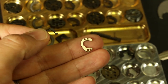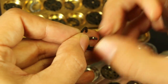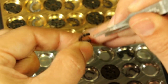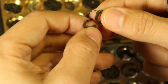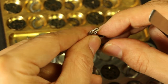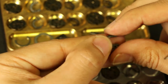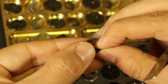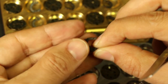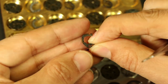So I'm wondering if these wafers have the same shape as the ones that have deeper false gates. The newer models have much deeper false gates — they look like a pinch right there. If you look from above, you can tell the difference because the true gate is open, whereas the false gate looks like it has a little piece of metal in the middle because of that little pinch. These smooth wafers don't have false gates of that nature. The older smooth ones also don't have the serrations — the newer ones all have serrations. The shape looks pretty similar though — I don't think they really changed much with the shape at all.